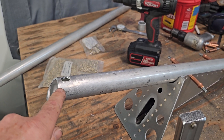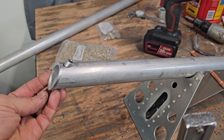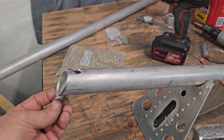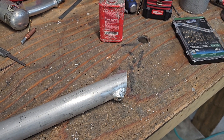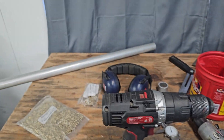So now I'm gonna take it over, put the spacer in, get it where I want it, tack it, then put it back in the wing and double check, then I'll finish welding. Got that welded into place, so now the next thing I'm gonna do is duplicate this on the other piece of tubing — that's the right angle, so we need to duplicate it over there and make sure they're both identical.